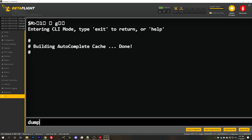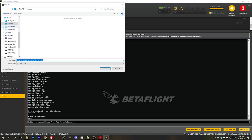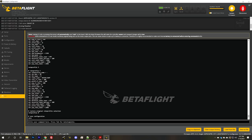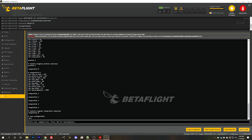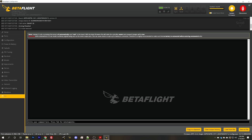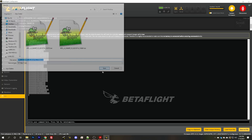Joshua from the future here. We're about to start screwing around with the CLI and resource assignment and all kinds of nonsense. Before you do anything like this, it's a great idea to go to the CLI and type 'dump all' and then save to file. Save that somewhere you can find it again. Then clear output history and type 'diff all' and save that to file as well. You could also go to the CLI and type 'resource' — that shows the resource mappings, which you could restore just by pasting them in. The full config dump also has this information.